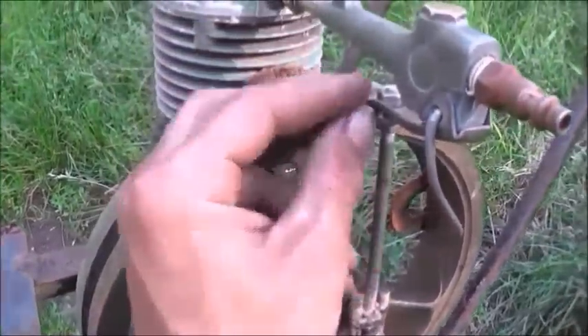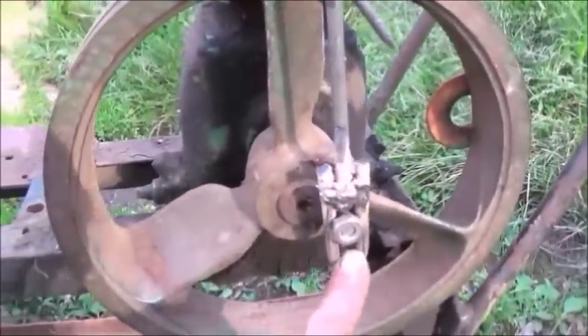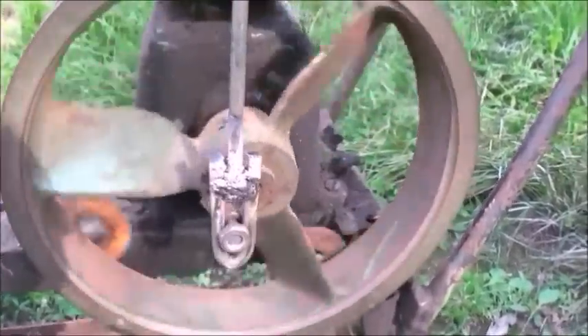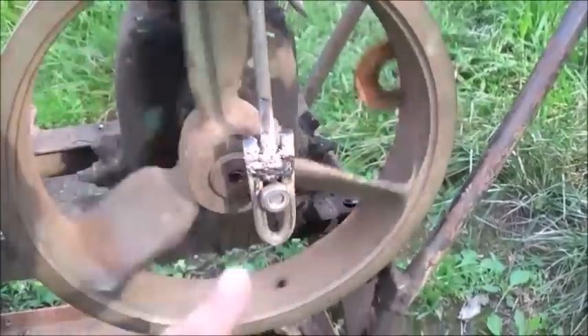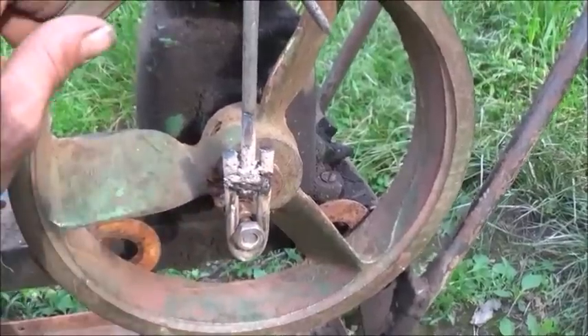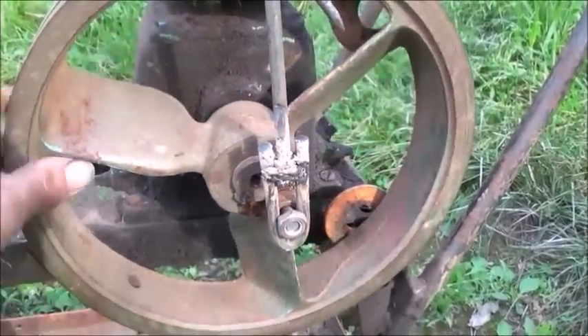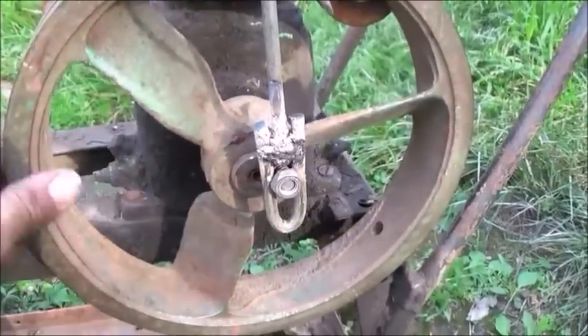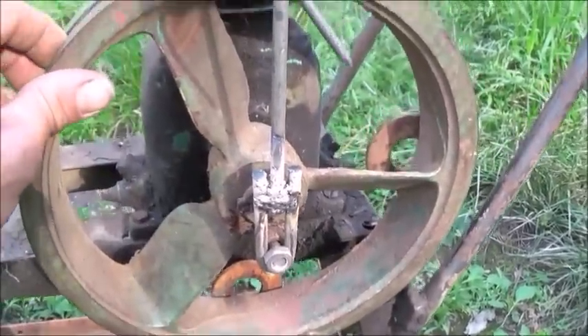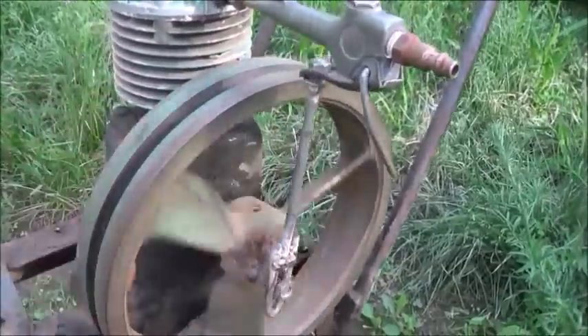You don't want to go too far off center to do that. It's a pretty short stroke. To absorb the extra, I have a little cradle or horseshoe, and you want two nuts on the bolt going through there and leave a little bit of slop between them, otherwise it's going to stiffen up. This is how you adjust your timing — how long it stays open and when it shuts off. After it goes past top dead center it turns off the valve and it stays off during the exhaust portion of the stroke. Comes up just past top dead center, opens back up the valve, and blasts the air through. You can see that all running together here.